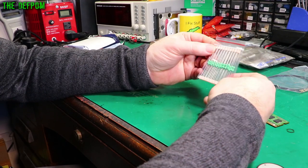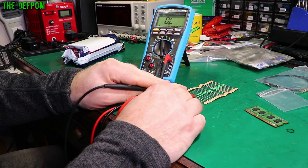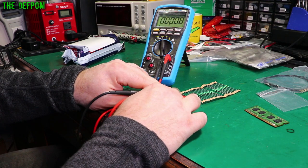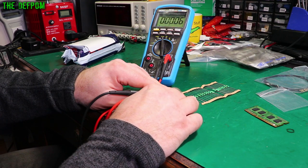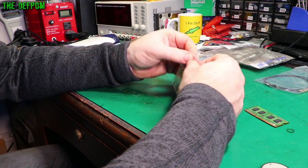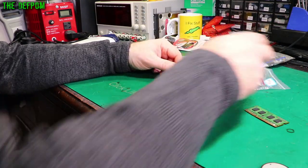These are fuses — 2.5 amp, as you can see on there. I thought it would be handy to have some 2.5 amp ones. Measuring the resistance: about 0.15 ohms, then 0.12, then 0.06. Getting 0.06 consistently — so basically no resistance, just the fuse wire. There'll be links for these things down below, for the UFLs, the fuses, and the USB outputs.